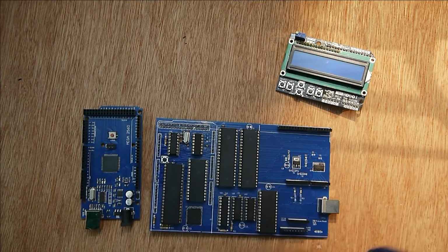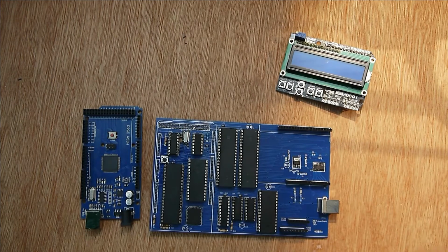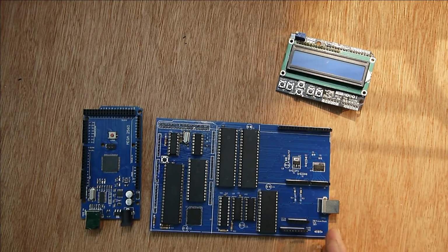So as the Z80 executes, it'll execute one instruction, and then if you want to see what is in the registers, the Mega then executes a small program which presents all the registers out on the bus, captures the values, and then puts the internal state of the Z80 back to where it was. So the program counter and all the register contents are put back to the state they're in after that instruction that just executed finished. So you execute an instruction, and you run this other code which enables you to grab all the registers, and then the state is put back as if nothing had happened,